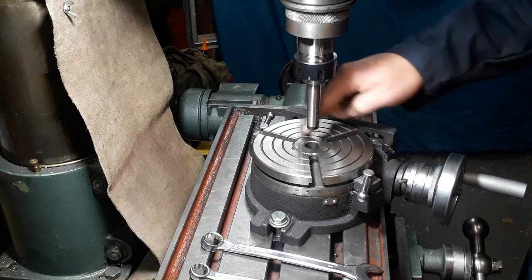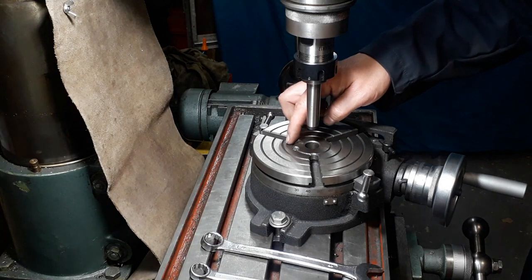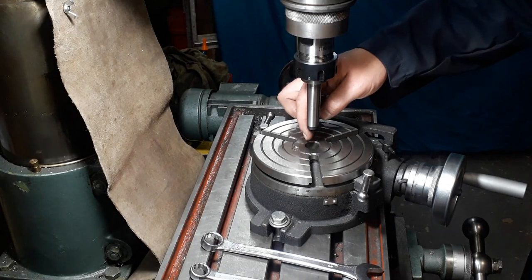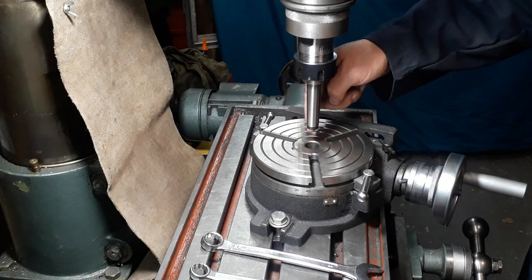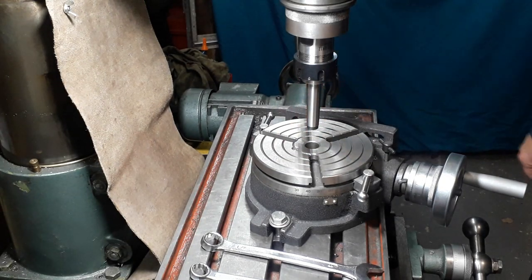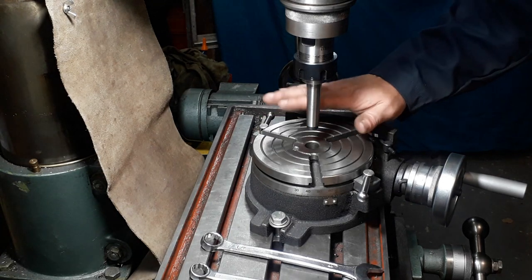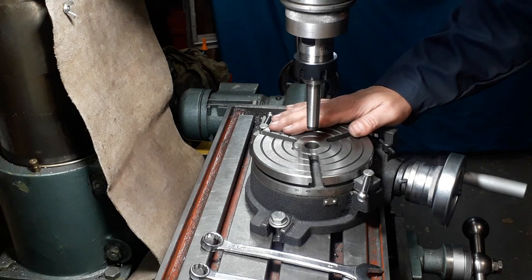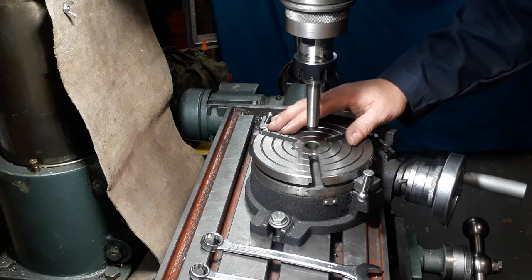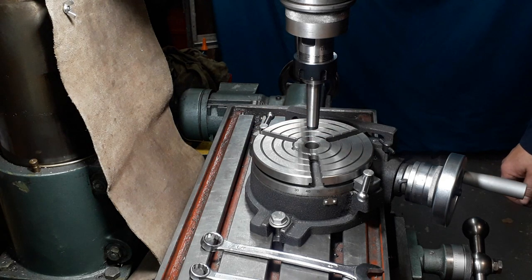So you can offset a certain amount if you need dead center that way, so you can do a radius on the end - like with the conrod on the S50 - you can do your radius because you know you're centered that way and offset that way. So that's the top tip for today. I hope you find it useful. If you have any questions please put them down below, and if you don't mind telling your friends to like and subscribe that'd be fantastic - it helps us to do more of these videos. Until next time YouTubers, as always, it'll be ready!